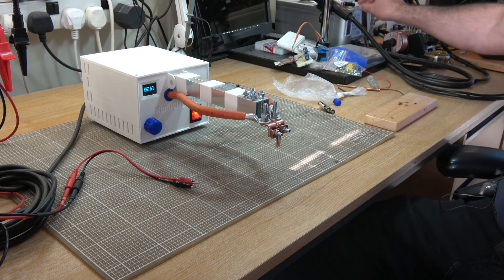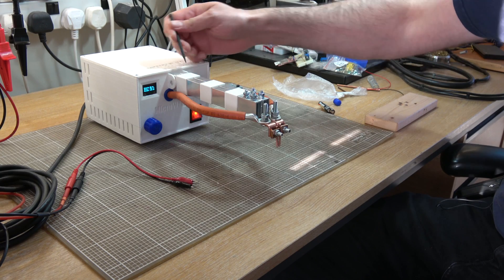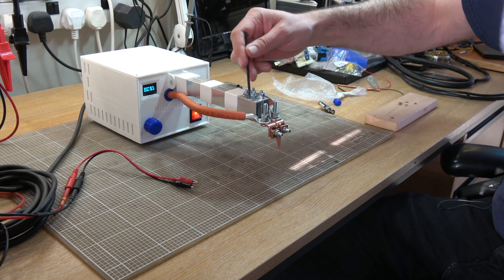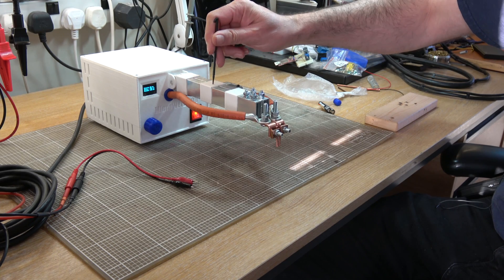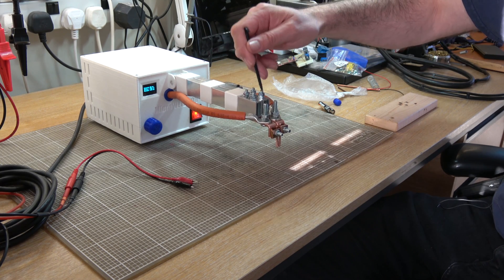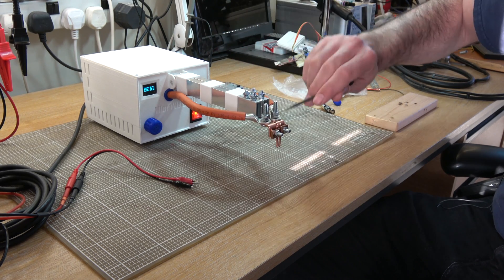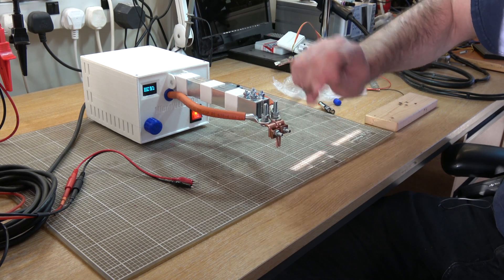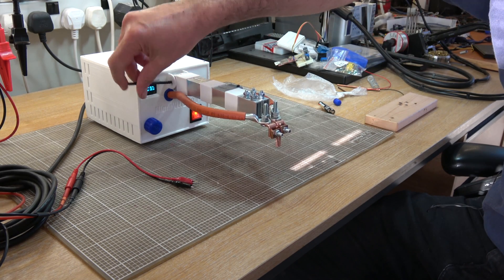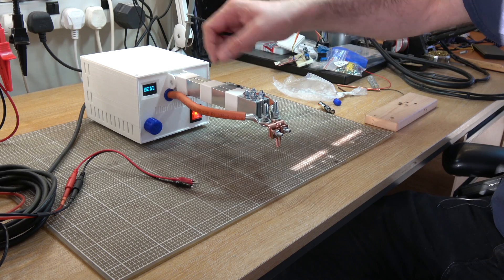After another few hours of sawing and drilling in the shed, we're up and working in what I believe will be my final configuration. I cut two inch-by-half-inch sections of 2 mil thick aluminium and replaced the plastic swing arm. I designed some clamping brackets to maintain the space between the two — although we've only got two volts between them I obviously don't want a short circuit. Screwed the micro switch on the side, slightly improved the clamping, crimped the terminals in. The hinge mechanism is just the sleeve of a biro sawed in half, because I needed something non-conductive.